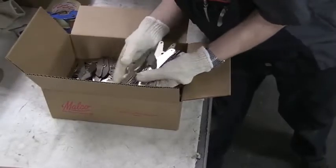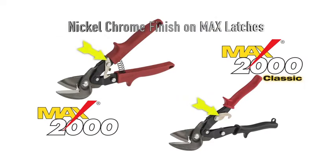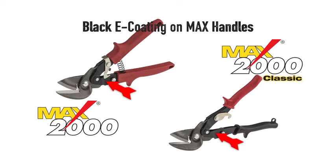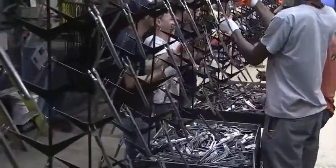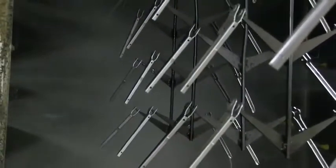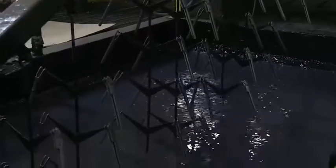Unracking the parts understandably gets white glove treatment as the parts are boxed and staged for assembly. In the case of the Max 2000 and Max 2000 Classic aviation snips, this somewhat elaborate plating operation is only employed for the handle latches. Max handles are protected with a black e-coating — 'e' for electro deposition. Tradition is our only explanation for the black handle coating, but it's a durable finish.